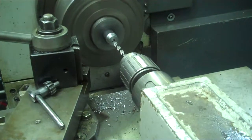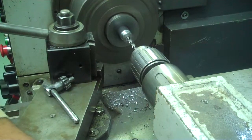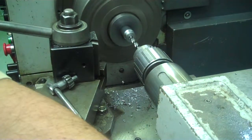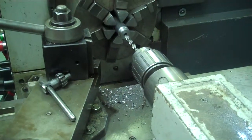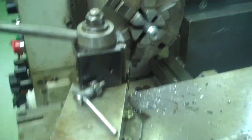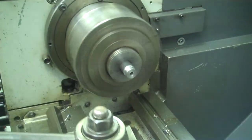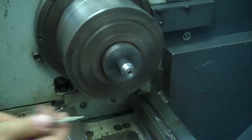I'm going to go a little bit deeper. Now that I've drilled my hole, I can back off my tail stock. I'm going to use my deburring tool and lower my RPM. I'll make sure everything's out of the way when I go to deburr — that breaks the sharp corner.